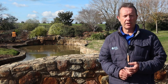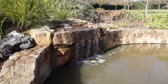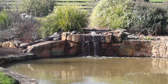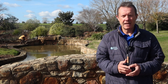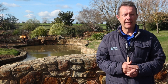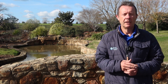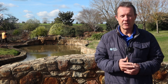G'day, I'm Scotty Tucker. In this video I just wanted to show you an aeration system that we put in a somewhat small dam. The client's logic was that they wanted to have the waterfall running to help aerate the water, which is what most people commonly think is going to happen when you set up a waterfall like this. But the reality is it doesn't really aerate a water body of this size sufficiently at all.